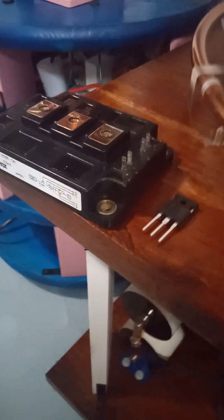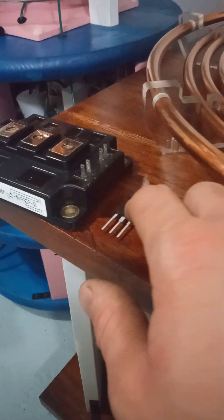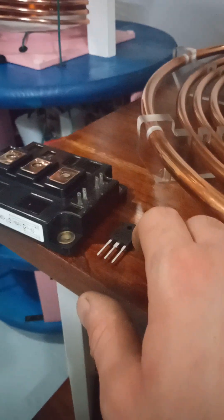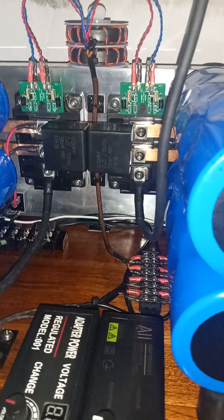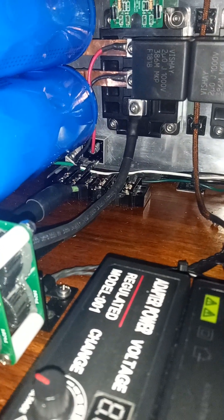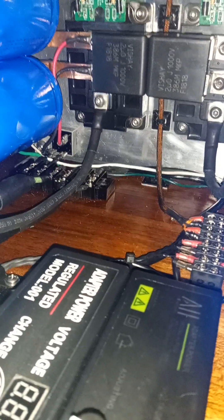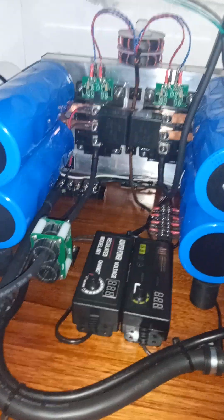When it comes to playing with these brick transistors, they're not like the tiny transistors — this is a whole new ball game. You're not going to blow these up easily, unless you have them phased incorrectly and you blow the gates. The small ones you can blow up all day easily, but I am still on my first set inside this coil ever since it was built — never had a problem. If you get it right, you don't have to worry. I have a new rectifier going in — probably a Sanrex 160 amp, because there's a little 50 amp Chinese one in there now, and I'm surprised they last as long as they do. I've got to be careful before I get the new rectifier.